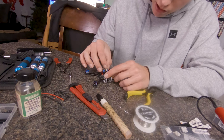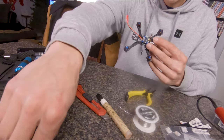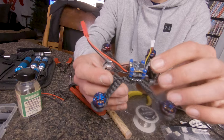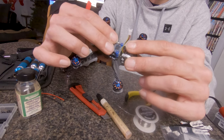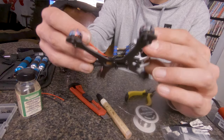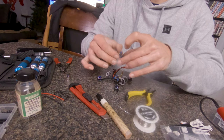The ESC is installed, so we're going to go ahead and install the flight controller on top of the ESC, lining the pins up as they're supposed to be. It looks like we might get two nuts on top of the VTX, but two of the holes are probably just going to have pressure on them from the top plate - it'll fit but it's going to be really tight. That's how you get the iFlight stack to fit in this frame.